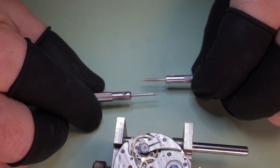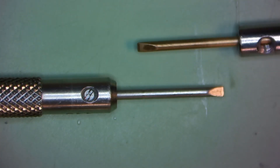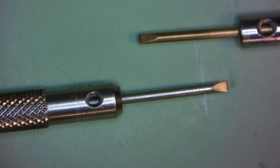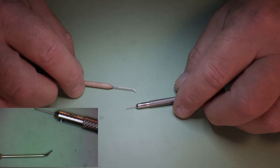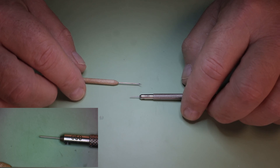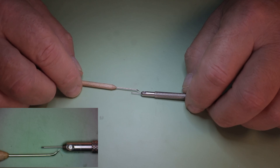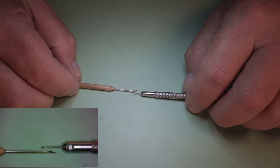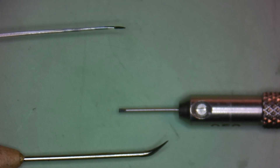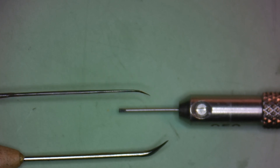Since we're going to be taking the same screw in and out many times, one of the things I like to do is use beryllium screwdriver tips. It's not absolutely necessary, but for a dollar and a half to two dollars a tip, anything I can do to prevent damage, I like to do it. To turn the collet itself, a lot of people like to use a small screwdriver, which works fine, but my needling tool also works well and has a longer reach inside the hairspring. If I'm dealing with a very small collet — say in a ladies' watch — I have an even smaller needle that I use for adjusting regulator pins.